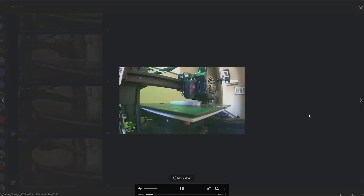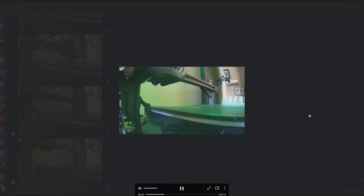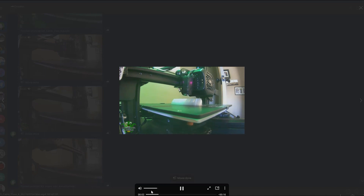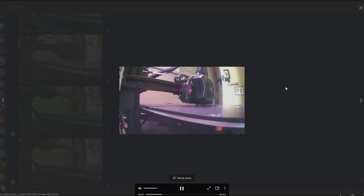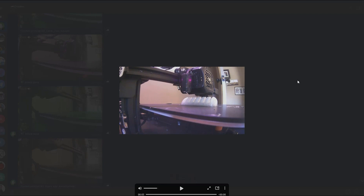For our last category, we'll talk about one of the coolest plugins for making awesome time lapses — it's called Octolapse. This is a plugin that everybody who uses OctoPrint knows about. OctoPrint does have built-in simple time lapses, and I'll show you the difference between the two. The built-in one takes a picture every time there's a z-axis increase, which makes a nice video. But with the Octolapse version, it sets the print head to the exact same position every time, giving you a really cool creation shot that is not available in the built-in one. It gives you a growing effect versus the actual movement around the print, which is great for tall objects.